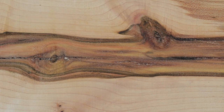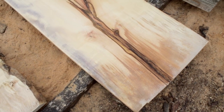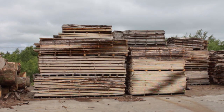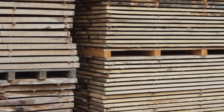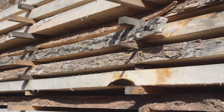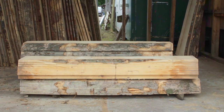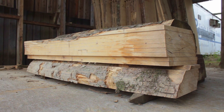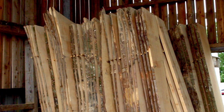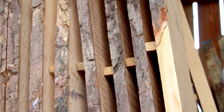These have come from an old tree, and quite a rough one in terms of quality. It was probably an upper length of the stem rather than the base — the butt. But look at how beautiful these boards are going to be, from a log that would normally be considered just as firewood. In front of us here we see some air drying beech and ash, drying in the usual way, pinned or stickered, using narrow strips of wood that separate and support each layer so that the air can move freely between the boards, drying them as it goes. We can't do this with sycamore. Sycamore is more capricious, and here we end-rear each board. This avoids a problem we would otherwise get with staining caused by the stickers — the bits of wood separating each layer of boards — called sticker staining. That stain penetrates right into the wood and doesn't come away with planing, and it really spoils the appearance of a nice finished board. Once end-reared for a while, this allows the surface of the board to dry, and it can be stacked and stickered later on in the usual way before going into the kiln.